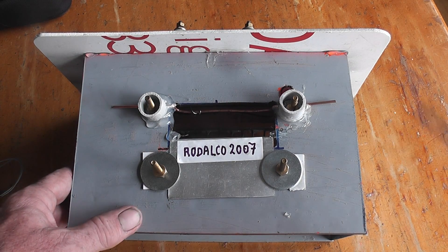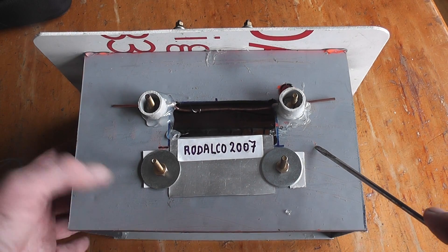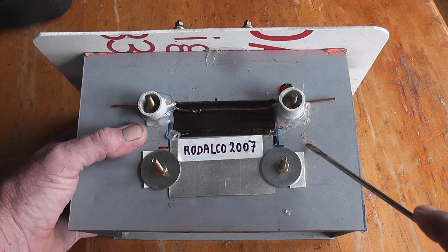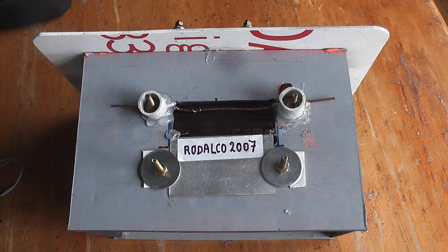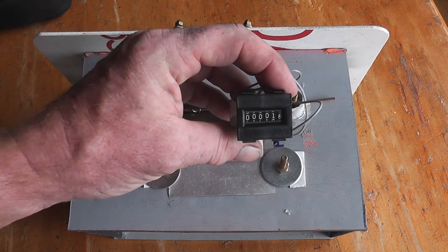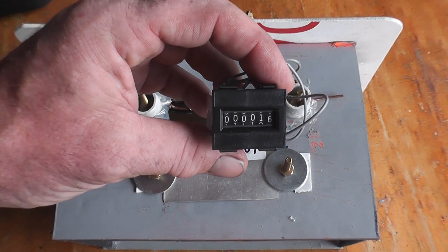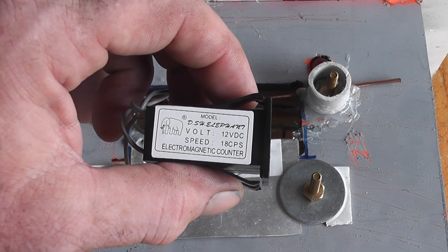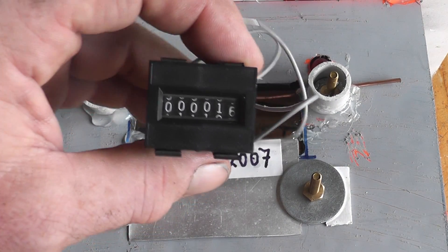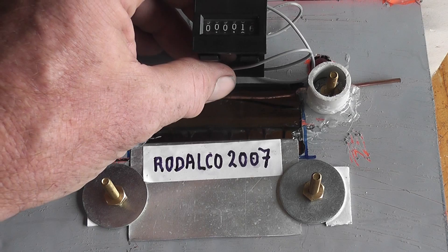The other thing I've stuffed up and forgot about: this is actually Meg's Lab and I spray painted it with zinc spray which is conductive. Hence I ended up with excess partial discharge. I also got from eBay a compact impulse counter — 12 volts DC, but I'll put a resistor in series for 24 volts. I'm going to implement it in the device as well.